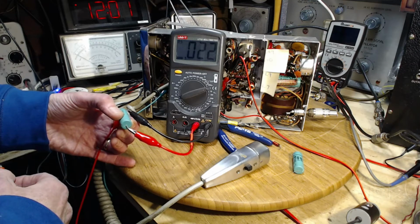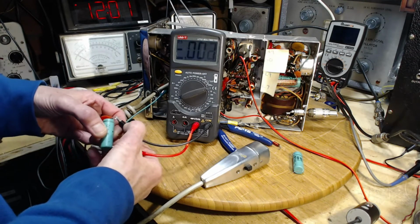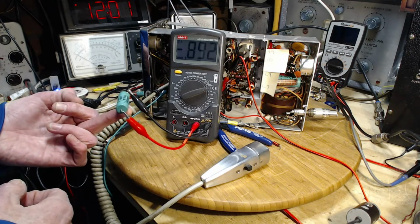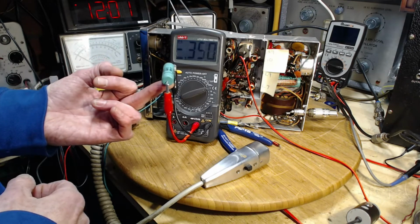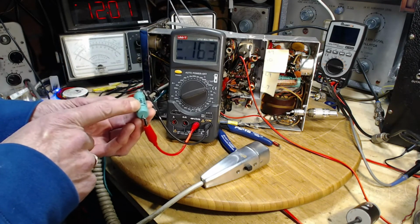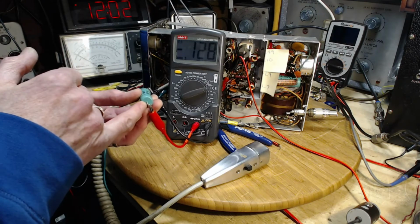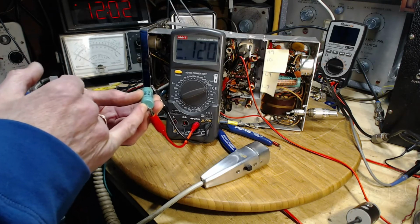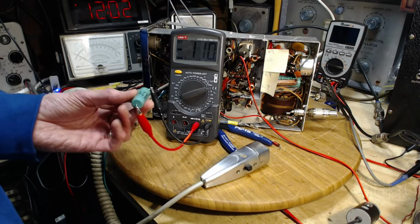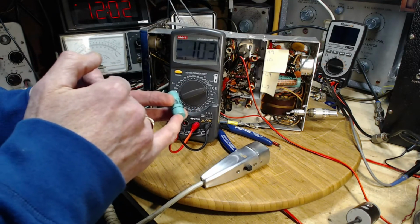This is not a very quantified test I'm doing here. This is much less than this guy. I guess too you would get a polarity. See, there was 1.5 volts on this thing when I first hooked it up. 1.5 volts. What have they got inside here? It's going to be some mixed metal stuff going on inside, probably aluminum foil, and then steel leads or plated copper leads, something of that sort coming out of here. There's your two metals. Look it up on the electromotive force scale. You'll find out aluminum is very electronegative. That's probably what we have: an aluminum copper or aluminum tin or something like that battery here.